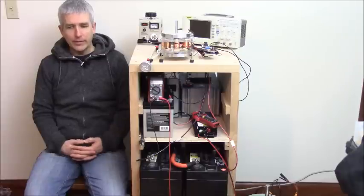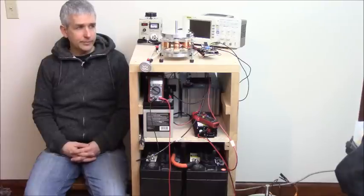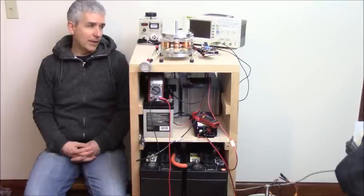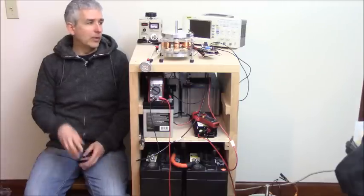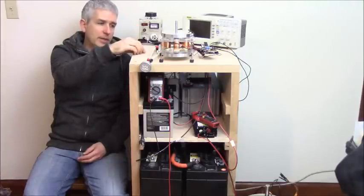Now the problem is you have to have a suitable battery bank to be charging, otherwise it will blow out everything. If we run it at that high voltage, we actually have to have transistors that are in the thousands of volts, and the same thing applies here. If we go up to 48 volts, I have some MOSFETs that are 1700 volts. What I have right now is a 900 volt MOSFET on there, rather than the 100 volt one right here, what we normally supply. This is a very good transistor, or a MOSFET.